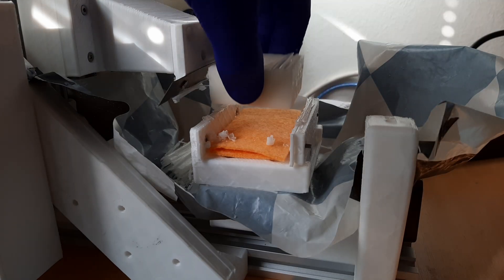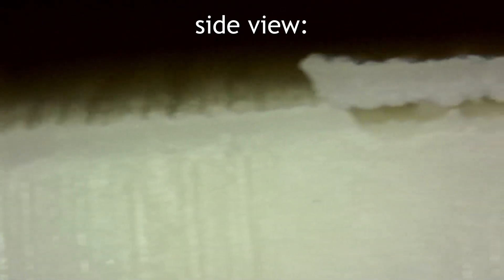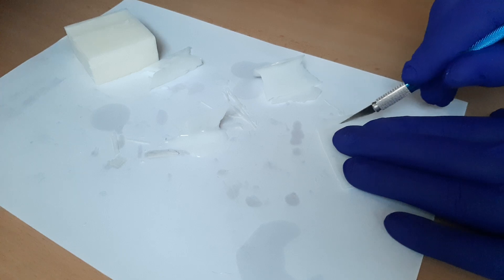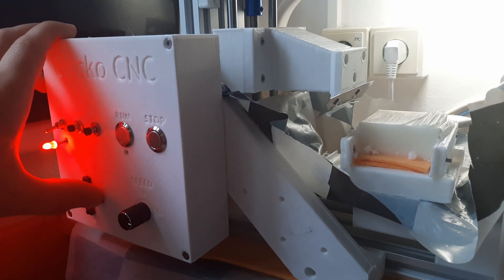I took the workpiece out, shook off the wax chips, and then I looked at it under a microscope. This doesn't look the best — there are some wedges, but they're not even, and there's not that many of them. I think the wax just isn't strong enough or the machining was poor. Despite the poor results, I decided to give it a try. I mixed the silicone and poured it onto the wax, waited for it to solidify, and was left with a piece of gecko skin. As expected, the gecko skin doesn't really work. That could be because the wax doesn't have the right properties, or the feeds and speeds weren't right, or the pattern is just wrong. So I'm gonna do some more research, play with these settings, and hopefully I'll have a working gecko skin by the next video.